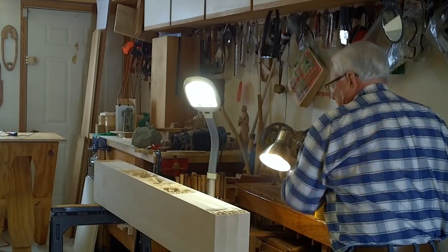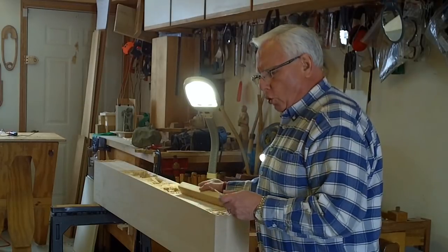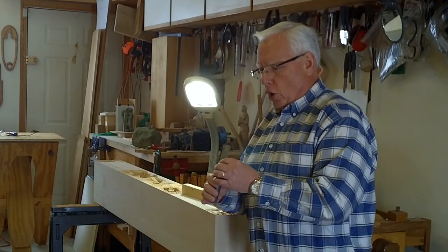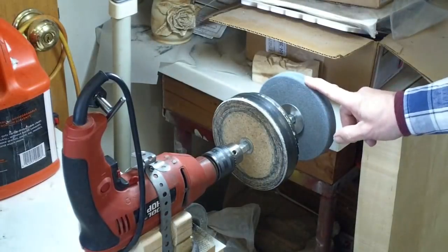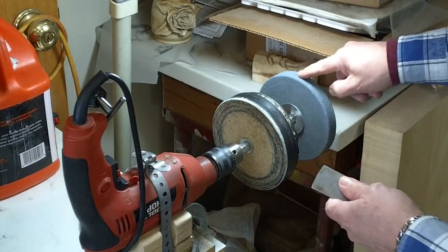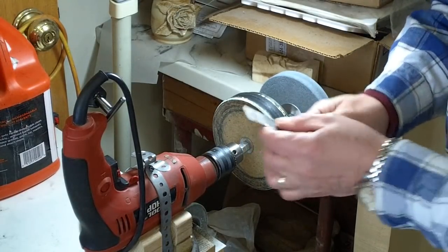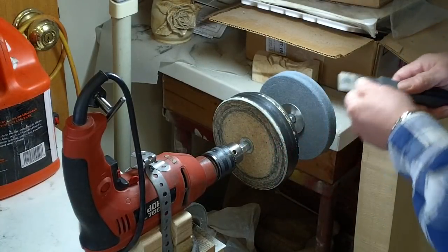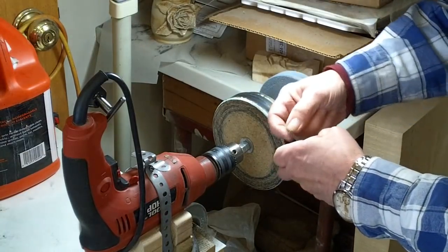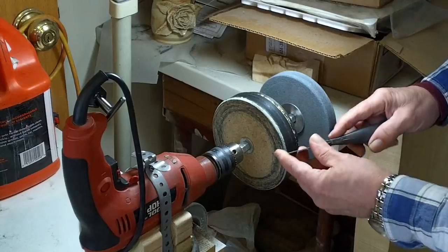In doing the sanding, the first thing I do is take that ridge off with a scraper. I'm going to show you how to sharpen and use a scraper — I'm using a regular putty knife. I have a grinding wheel and a buffing wheel. For this scraper I'm just going to use the grinding wheel and go perpendicular to the wheel because I want to raise a heavy burr, because it's that burr that's going to be doing the cutting. I'm not sharpening it like a knife; I'm grinding the end perpendicular to raise a heavy burr on both ends so I can scrape one side, and when I lose that burr flip it over and scrape the other side.